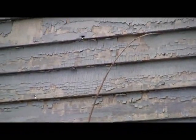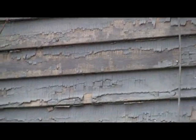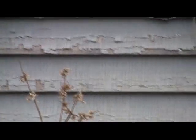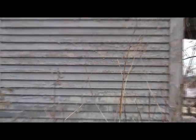I love this old lap siding — the old shiplap — and I think it's saveable. There's physical labor involved in removing the old paint, and because of the age of the house it will be lead-based paint. We need to follow all the protocols for safe removal of lead-based paint. Because it's such a good teaching opportunity, we'll actually teach the techniques used to safely remove lead-based paint.